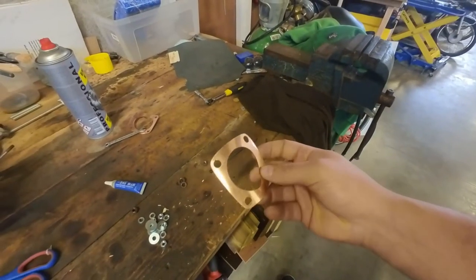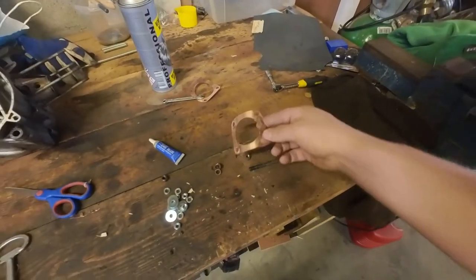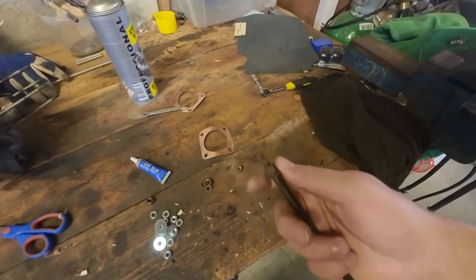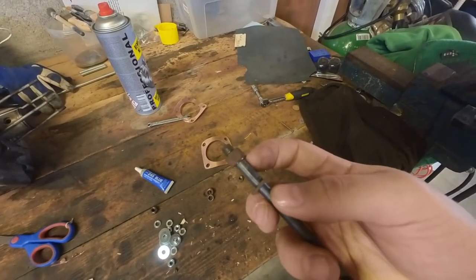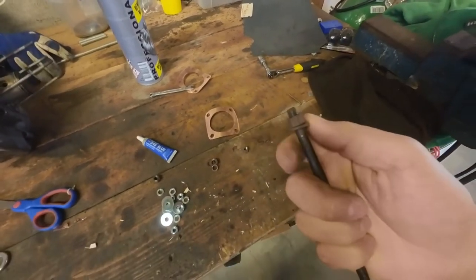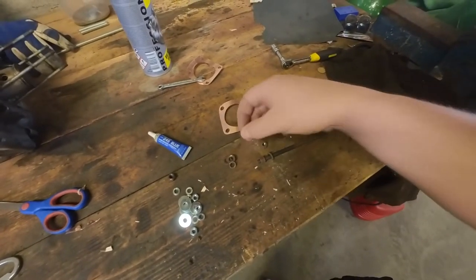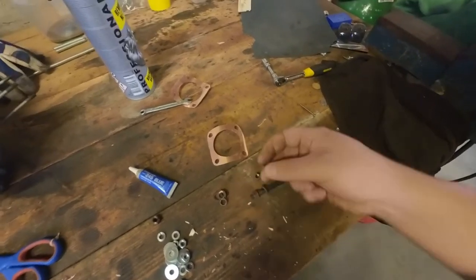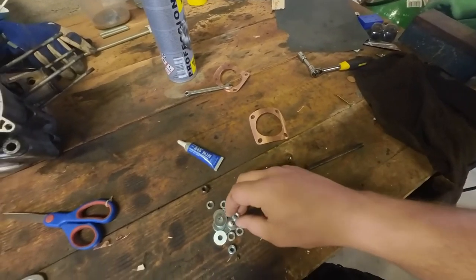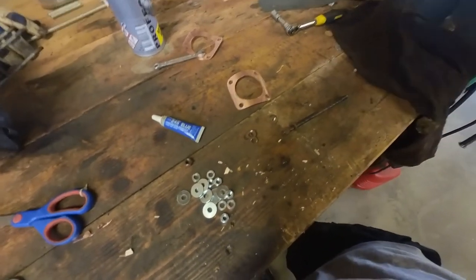So I made some extras. And this time I did add my holding tabs. So now we have a clean cut. However, I think two might have been enough because when I wanted to loosen the head, I found out this nut was actually tight onto the stud and not onto the head. So I will have to add a washer, but I think it will be time just to grab new hardware because some of these spring washers actually just broke and these nuts are all worn. Yes, it'll pop off and won't look pretty, I think. An old cylinder with new hardware, but I have no other choice.